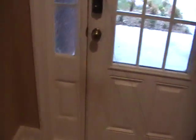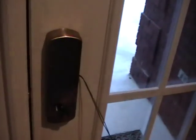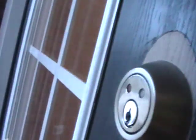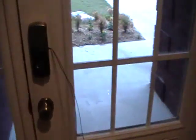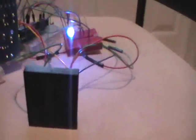This is where I'm at on my RFID door unlock project. This is the deadbolt I got — I can post a link in the YouTube video. You can unlock it manually; it actually has a wireless key fob to lock and unlock it, but I just wire directly to the motor. The two wires from the motor go to the motor driver connected to my board. Right now I've got two nine-volt batteries powering it, and there's a status light. This is the ID-20 RFID reader.